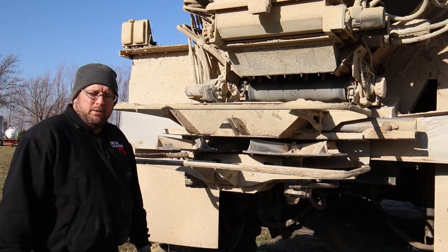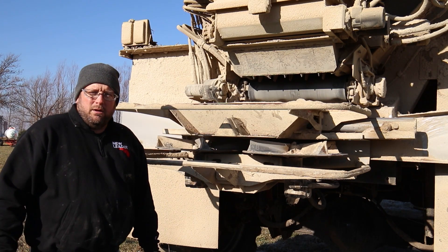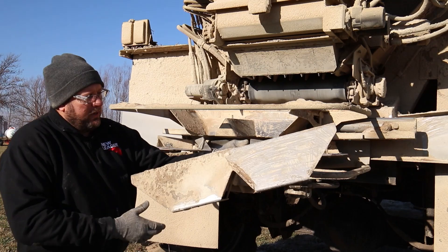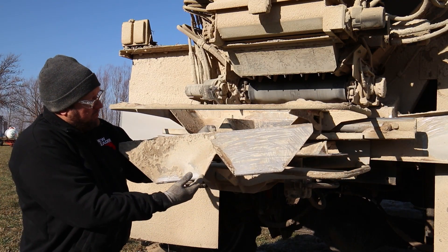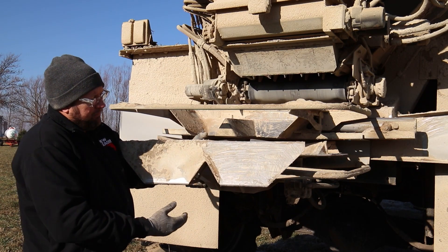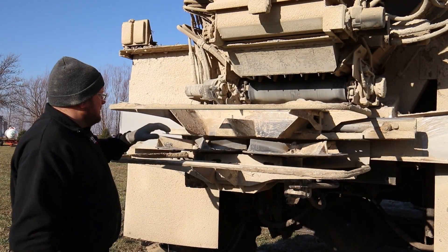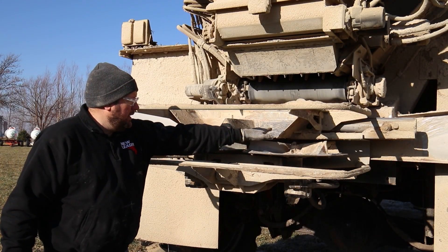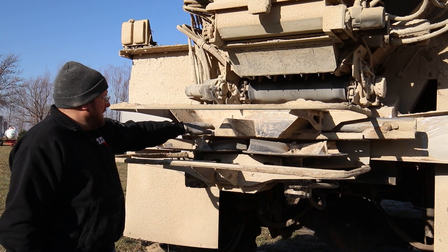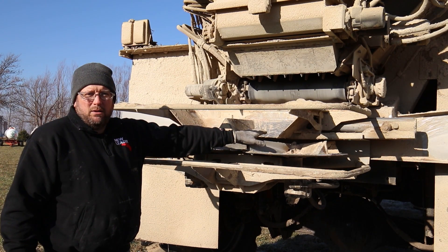The next item you're going to want to look at is removing the material divider back plate. Very simple and straightforward. What we don't want to see is product buildup on the face of that back plate. Here I've scraped it off down to bare metal. Also with the back plate removed, we want to inspect the front face of our material divider, and again as you can see, any material buildup we're going to want to remove and take it back down to bare metal.